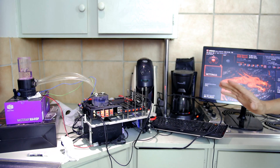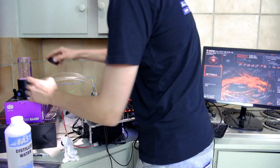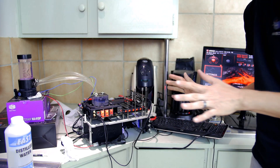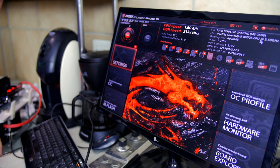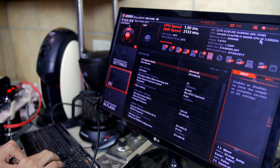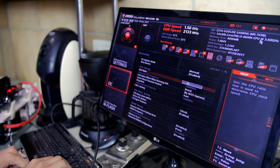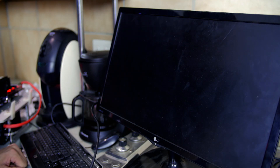Everything's fine now — you can see we're in the BIOS. There's nothing wrong. We just need to leave a little room so that we can add the coffee a little bit later on. The pump is running, the water is actually circulating, so we're 100% good to go. Now, in the BIOS, you can see that I'm actually running the CPU at 1.5 gigahertz — that was just because I was doing some tests earlier. We're at 30 degrees Celsius right now. We want it to be stable in like the 90 to 95 Celsius range. So let's set this to 4.5, since the all-core boost on the 8600K is 4.3 — so we're actually applying a little bit of an overclock.